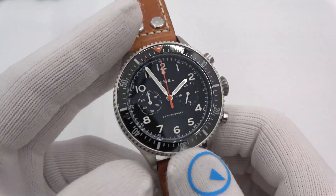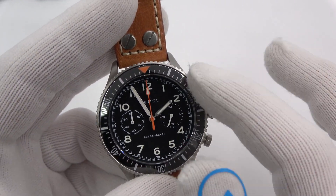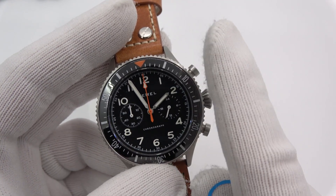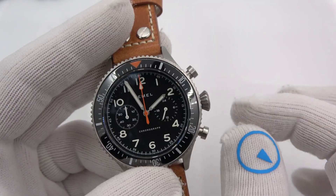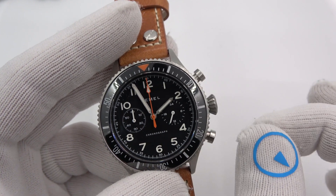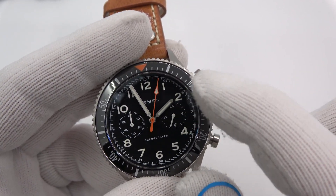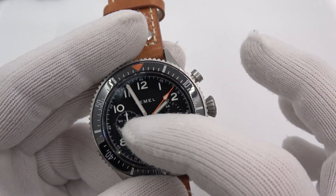So what's going on here? I'm not going to open them up and show you inside because I don't want to break the watches. It is a quartz-driven movement — there's a battery and there is a quartz oscillator, and that is controlling the motor. There's only one motor, there's basically one driving device — one engine, if you will — and that drives the hands. There is a gear train that is usually inactive, but when you activate the chrono with that click, you are actuating that mechanical gear train to interface with the running train of the watch, and that causes this hand to move.